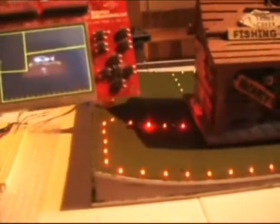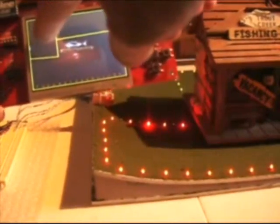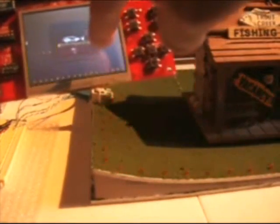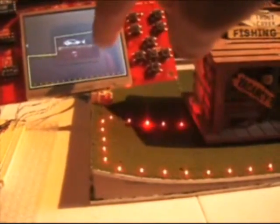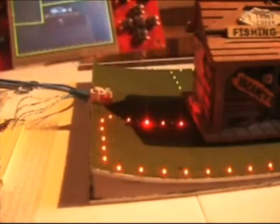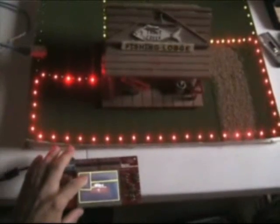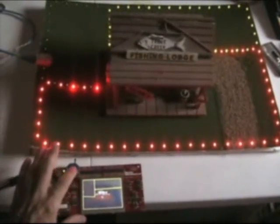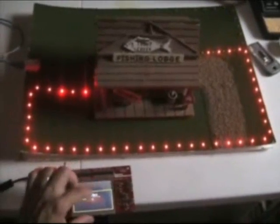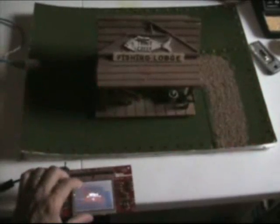When we touch one of the zones on the controller, the zone state is reversed. The current state of the zone is indicated by a yellow border around the zone if it is activated, or no border if it is not activated — in other words, zones with borders are the areas where the dog is confined. By default, all zones are activated on power-up as a security measure to prevent the dog from escaping in the event of a short power outage. The state of the zone is determined by requesting the information from the relay board rather than just storing a flag within the controller itself. This is also an important security measure to prevent the state from getting out of sync between the relay board and the controller in the event the controller is powered off and the relay board is not.